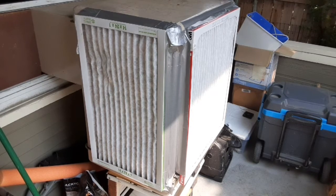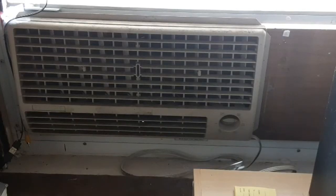Let's take a look inside and see how it's running. It's running pretty good — air is coming out cold and it doesn't smell too smoky right now. So that's a pretty quick and simple way to put a filter on your swamp cooler so you can run it and cool your house down when it's 100 degrees out but not have to take the full effect of that California wildfire smoke. One bonus feature I noticed: after about an hour of running it, it was running a lot cooler than usual — not drastically, but a good five degrees cooler.